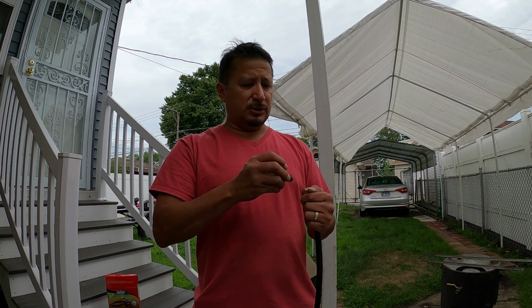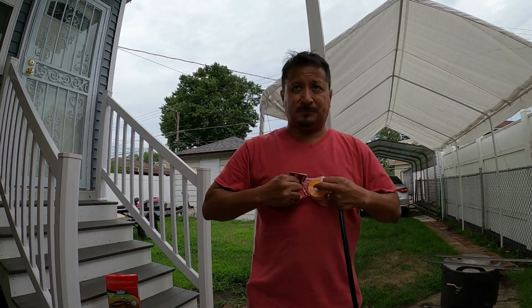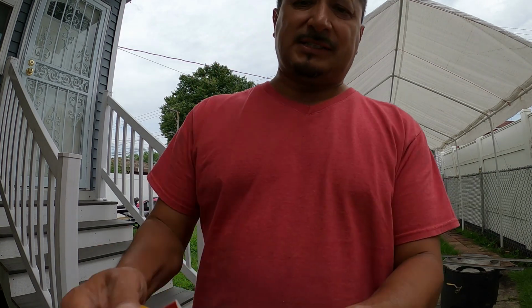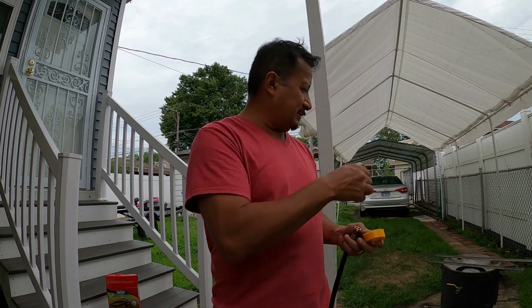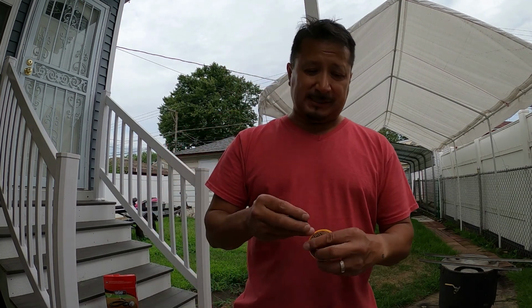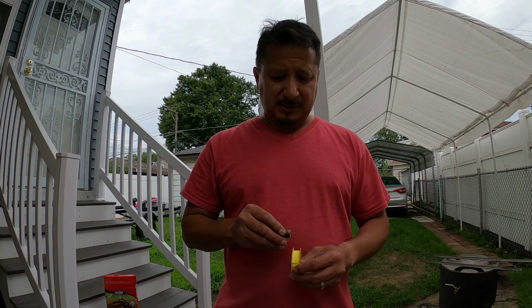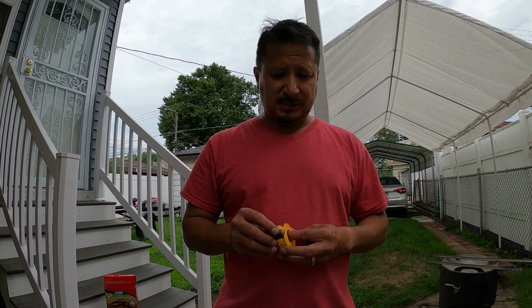Good to go. Okay, USA. What I did buy was gas Teflon tape. Gas rated Teflon tape. So the first thing I'm going to do is put some Teflon tape on this and put it back on that still. And also, if you bear with me here, I do got a tester now so I can test gas lines and everything. So when you put this on, you got to stretch it.